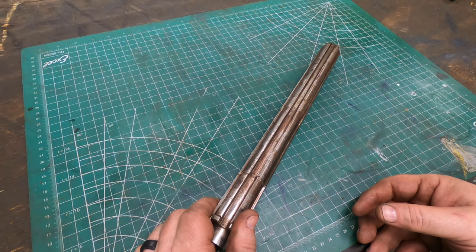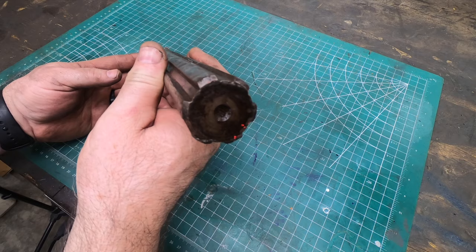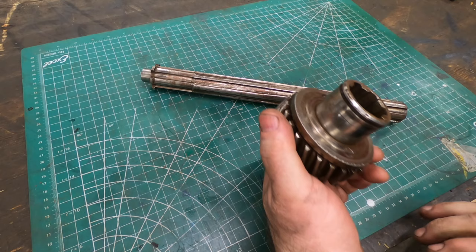This is the drive shaft out of my K&T Universal Milling Head. This is a shaft that a sliding gear rides up on, and you might be able to tell from the video that these splines are horribly worn. That line at the end of the shaft almost looks like this might have been fixed in the past and is two pieces, although it's really difficult to tell if that's just wear or if it really is in two